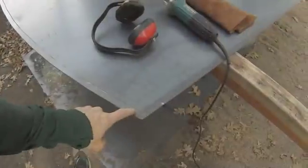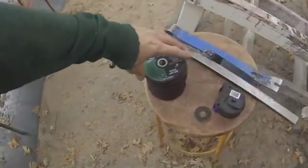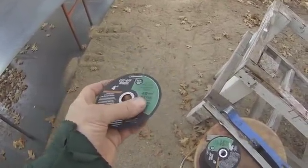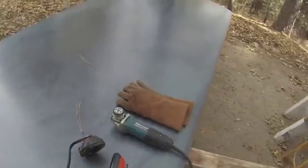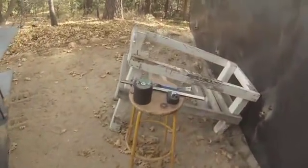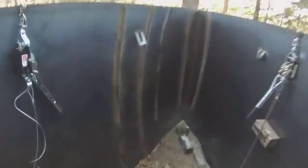Here's the final result. I haven't welded yet but I wanted to show you there's really no gap left — that's fantastic. That method worked little by little, which is great because I can do that on every one now. It's taking about two blades per cut — 4 inches in diameter, about a sixteenth of an inch thick. I need to make 60 cuts total, so I'll use about 120 blades at 50 cents each — that's $60.